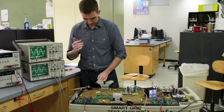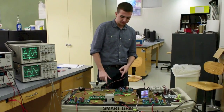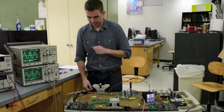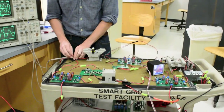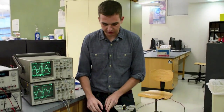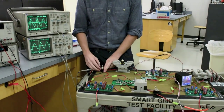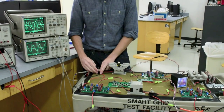I'm going to turn sync A off — the A generator, which is the one to the left down below. After switching it off, the motor actually spun up faster until I reconnected it to the grid, and then it slowed down and stayed in sync. This means the power is getting transferred to the grid, not taken from it. Let's try again for a longer duration and then sync it back up.